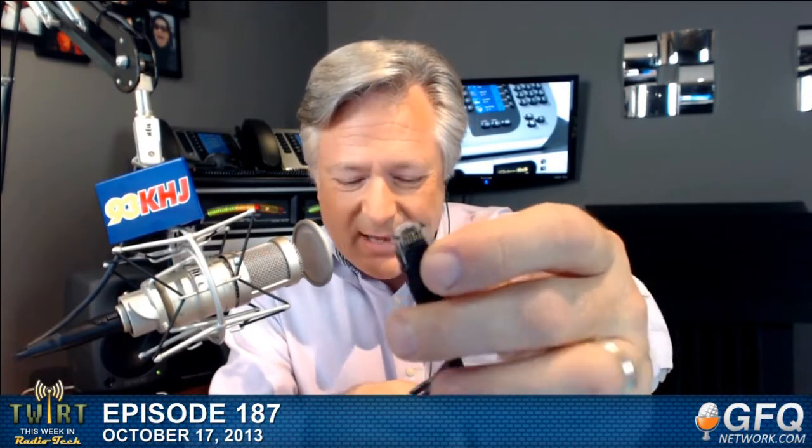And there actually is a difference. The RJ connectors for CAT6 are different than for CAT5. They should also include a little block of material in there. I don't know if it's ferrite material or just a black plastic to keep the wires aligned. I'm going to show you how to terminate a cable, and I'm sure that what I'm showing you is not completely CAT6 compliant, but it does seem to work for gigabit situations. So anyway, there's your patch cable. Use a flexible cable, which a patch cable should be, for anything that you're going to be moving around.